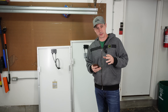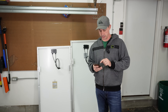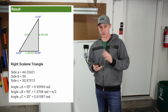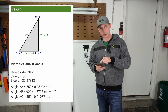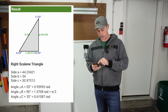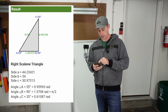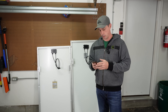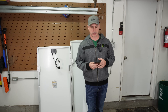I'm putting some numbers into a triangle calculator. I could have done it with math, but this makes it easier. Side B is 54 inches and I chose a 55 degree angle for wintertime. If I rotate and flip it onto the 44.24 inch side, I'll have a 35 degree angle which is better for summer. On the 30.973 inch side I'm going to put a set of casters — that gives me about 30 inches of clearance to move this around for mobility. I can just lock it down with some tie straps.